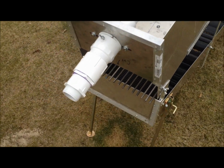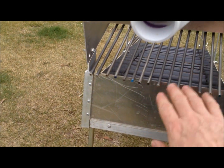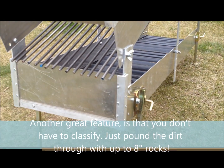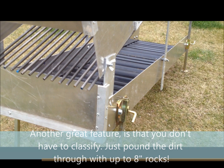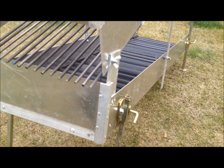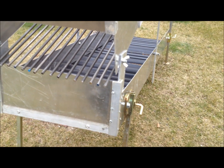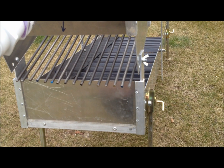I put a six-inch bumper plate back here because you get a large volume of water, so I built this up to about six inches. Then I added it to a sluice body that I got from South Yuba Mining — all I got was just the shell, the 48 by 12 inch, three-inch high sluice bed shell, nothing else. They build really good products and I utilized it for my project.